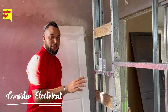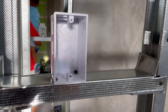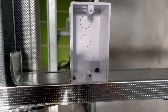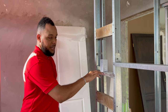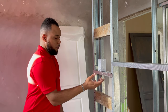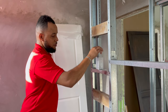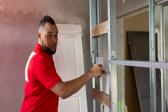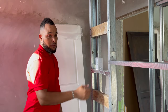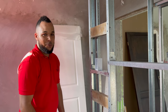The placement of electrical is very important when you do the drywall framing. We only have a light switch in these studs. What's important is that you need to measure the height that you want for the light switch and put some support to mount it on. We are going to mount it on the track we used here — you screw the box onto the track and you want to ensure that it is firm. If you want, you can give it more support, because you don't want a case where you turn on the light switch and the box pushes through the drywall.